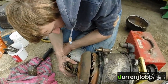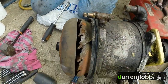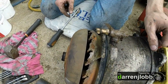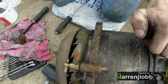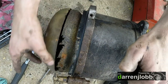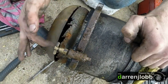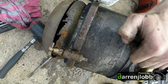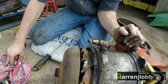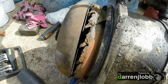We've got the end off and found the issue. This is the bottom, where all the water sits whilst it's resting — it's just sat there. If you look at the top half it's still fine. This is your stator and this is your rotor — it fills with water to load the dyno, one acts upon the other. Of course if this rusts out you lose the ability to load. I imagine it would still produce a fair amount of load, but not the full amount.